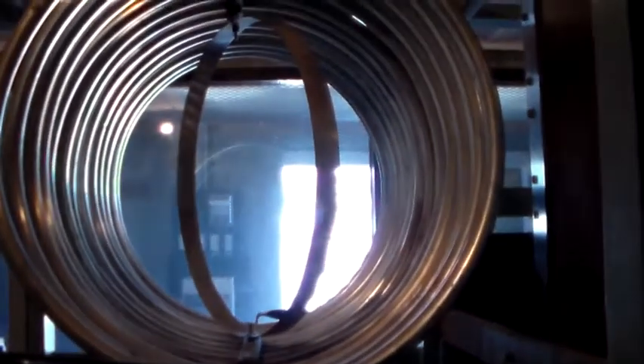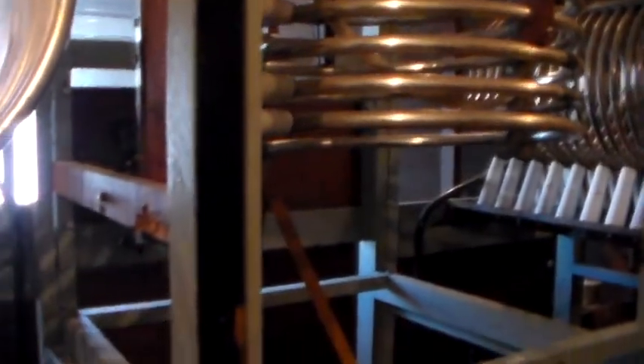Transmitter one comes in here, this is transmitter two. That big vacuum cap there — it's rated at 55 kV, adjustable from 5 to 500 pF. It's part of the series-parallel circuit. We've got a C in series with this inductor, in parallel with the other inductor. So at resonance at the wanted frequency, the series LC is short circuit and the other inductor has no effect.